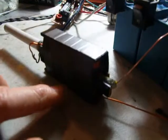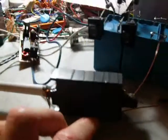So, the construction of the plasma accelerator is the following. I have two long coils wound in this way — one underneath the barrel and another one at the bottom. You can see from here how it's wound; the actual turns are long and go like this. The barrel is between those coils.